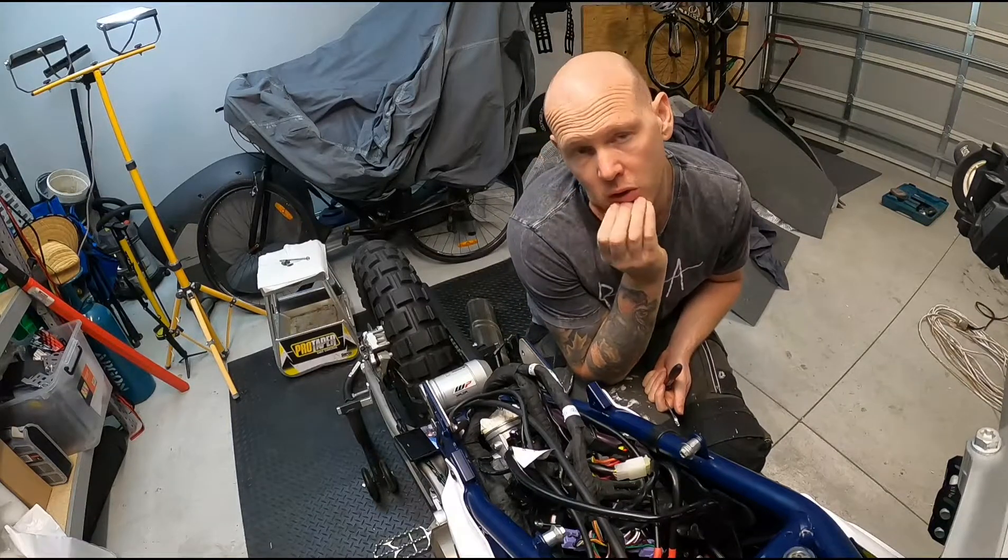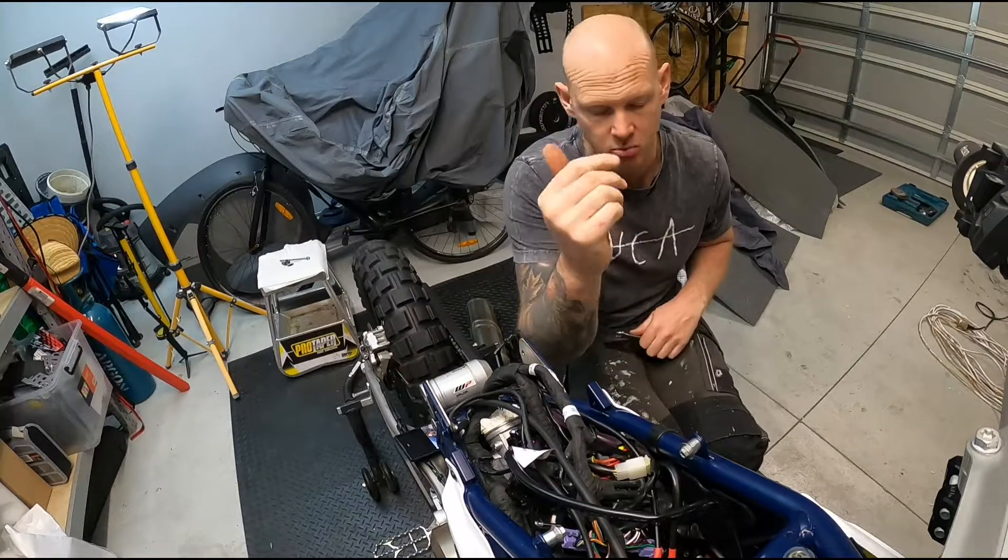I think what I'll do now is sand down the tabs where I've welded on the bottom there, because the paint is a bit burnt — I didn't take it back far enough. I just need to sand that off a little bit, get it looking a bit more respectable, then chuck some etch primer on there, wait for that to dry, and then put some of the blue paint on. So I've quickly sanded those bottom brackets down and given them a bit of etch primer — the next step is just to get the colour on.